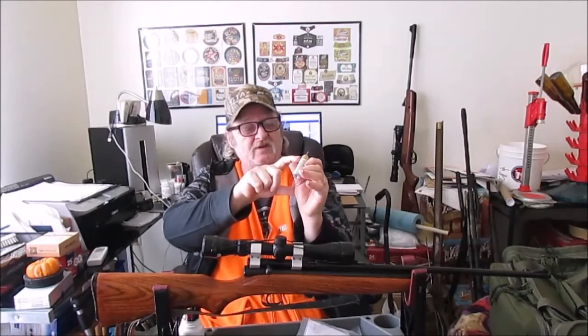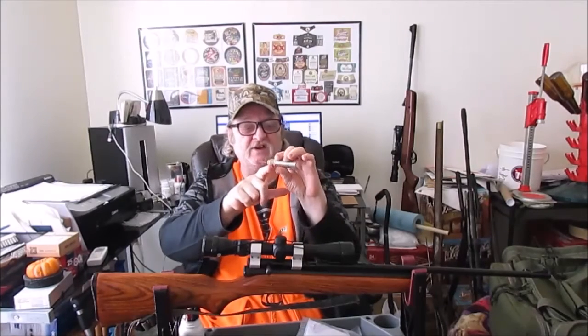Not only is the seal moved from here back to the front of the exhaust valve portion, and there's the exhaust port to the breech, and this is the threaded bolt hole that faces down like that, where that little short fat bolt goes through the bottom of the gas tube into the valve, in front of the breech and tip of the bolt. Anyway, you can see that slotted right there. That supposedly gives more gas volume per shot, so you're looking at a little higher velocity with that slot ground in there.